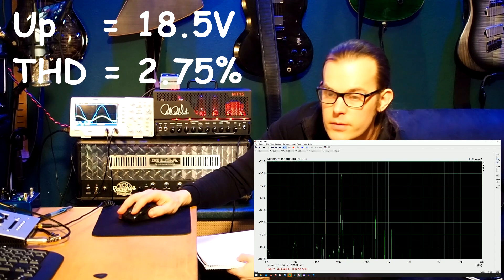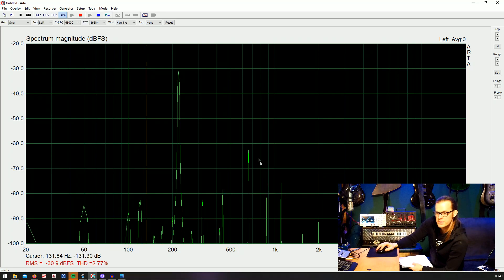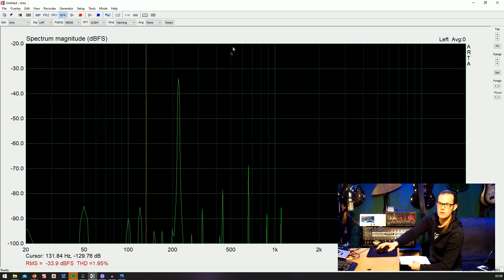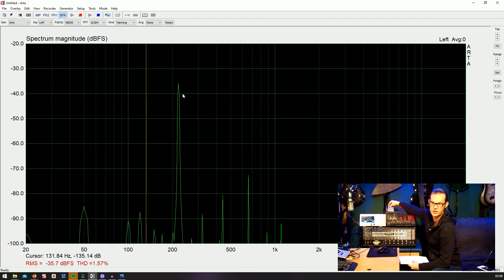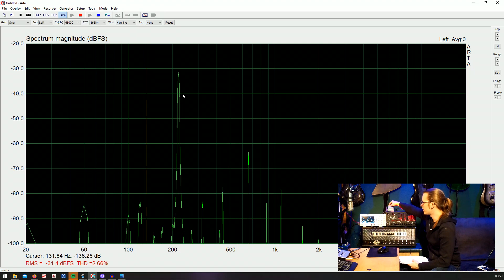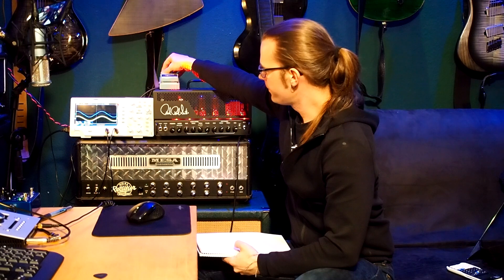Let me change the range. You can see the harmonic peaks here. If I turn down the volume, the peaks get lower faster than the main dominant frequency from the generator — that's the harmonic distortion spectrum. Now let's push past the point where the power amp is distorting, giving us a flat top and bottom. You can see a lot is changing: the third harmonic gets lower, then other harmonics get higher, then the third comes back up. There's something happening in sound shaping when we push to the edge.